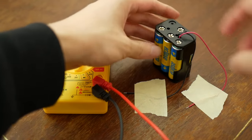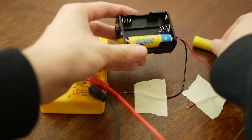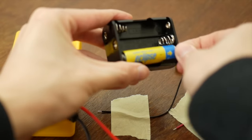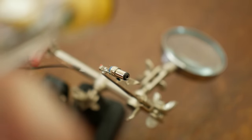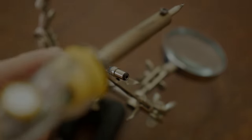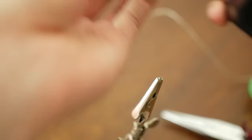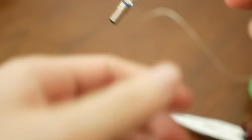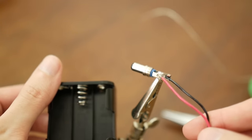Okay, almost done! It's time to solder an NES DC plug on. I'm gonna take the batteries out while doing this for obvious reasons. Thanks to the holder, soldering this thing will be a piece of cake. All we need to do is solder these two wires. And for the NES, once again in stark contrast to other electronics, it doesn't even matter which wire we connect to which terminal, because its rectifier will automatically produce the correct polarity internally. Isn't that amazing? Other than that, we are 100% good.